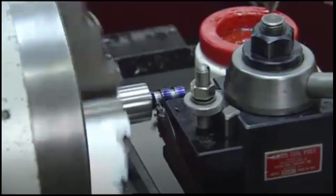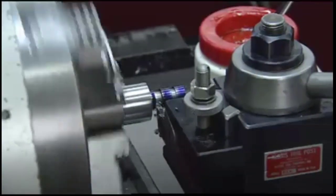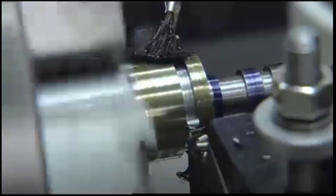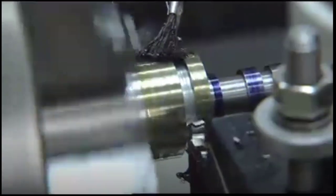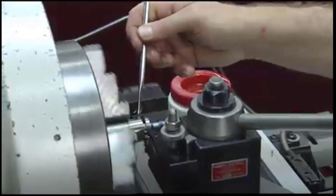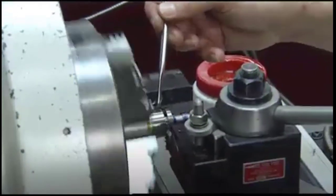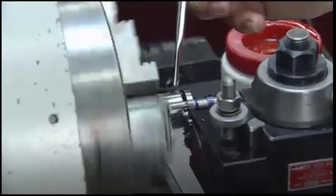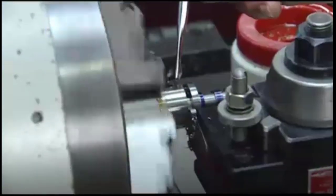During grooving and turning, there is a great deal of tool contact and heat created, so whenever you're machining very deep grooves or cutting off large diameters, it's always a good idea to cut to a partial depth first. Then make the groove slightly wider before finishing. This will prevent the tool from binding in the groove and breaking, which can damage the tool, the work, and cause serious injury to the machinist as well.